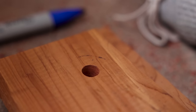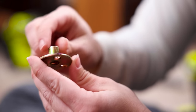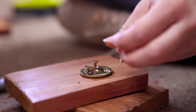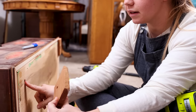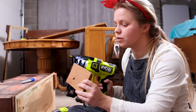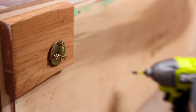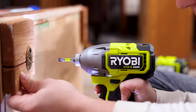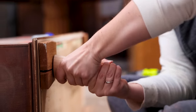Now I've got the Sharpie mark on the base, so I can line up the bracket exactly with that mark — including the mark on the edge. I'm attaching the block using my brad nailer with one-inch nails so it won't go through the bottom, and then screwing the bracket in. The screws are longer than the board is thick, so they'll go through a bit more into the chest base, which ensures a little more structure and security.